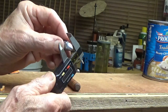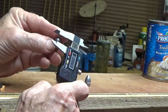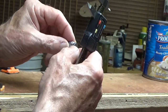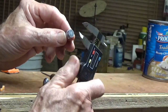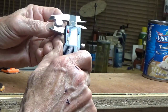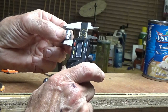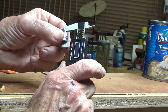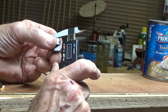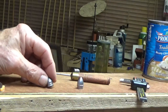On the Johnson bullet, that nose section I got .448 - right in there the same as the Lee, so not a lot of difference there. But the ring on the Johnson and Dow goes up to .463. So we're definitely going to be shaving some lead and getting a good seal on that section. As far as bullet length goes, the Johnson and Dow is coming in at .680 to .687 roughly, and the Lee is quite a bit shorter at .555. Big difference in that area. Those are the dimensions off our two bullets, so now we'll start seeing how they fit into the guns.